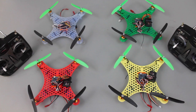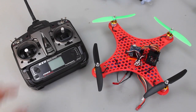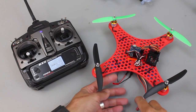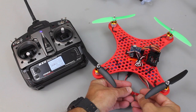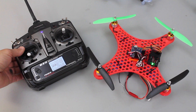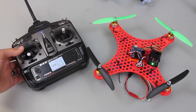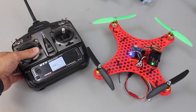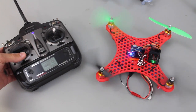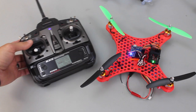It's been an incredible learning experience not only for the kids but also for myself. Now let me first demonstrate a properly working setup - I'm going to fire up what we call the red team's quad. You'll hear that long beep, which means the ESCs are initialized. I'll go ahead and arm, and then you can see if I give it some throttle - works really well, everything is nice and calibrated.